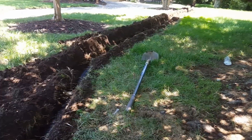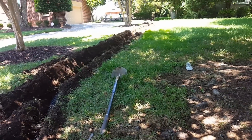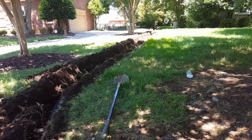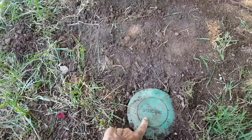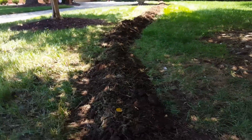Remember how a pop-up works — as water comes down the line it lifts up the emitter, and I can actually see water down inside there. Water is coming all the way to the end of the line, so from now on, whatever has been going on back there, this water has a place to go. Before it had no place to go, and that's pretty much what you're doing when you put in a drain pipe — you're just giving water a place to go. The bigger the pipe or the more downhill run you have, the better it works. If you don't have downhill run, you end up putting in a sump pump to lift that water and then have gravity bring it back out. Water is coming down the line already, picking it up from the yard in the back — a lot of water back there.